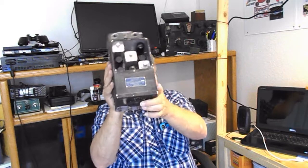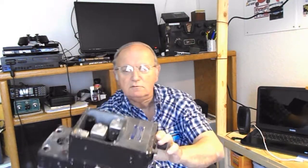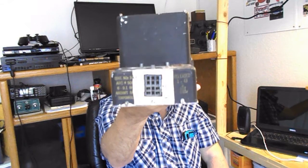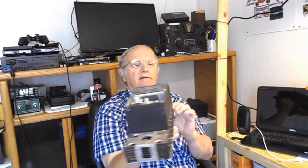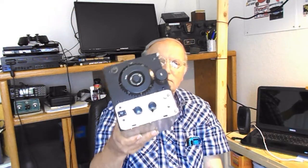And this one, look inside there. Those are all 12-volt tubes, not 6-volt like the other ones. And same thing, 3 IFs, the whole routine. But this one's been modified, and someone went ahead and put a plug on the back. It's a certain type of spade plug it's got on there. And then the front with all these knobs, obviously one is for tuning and the other one's for the BFO probably, and probably an AGC or something like that.